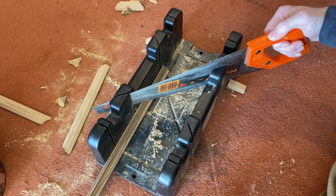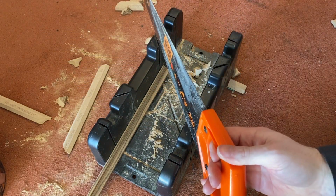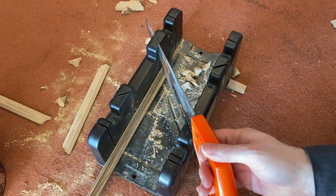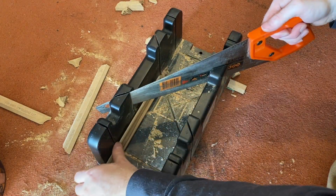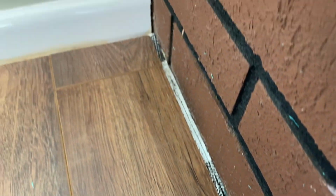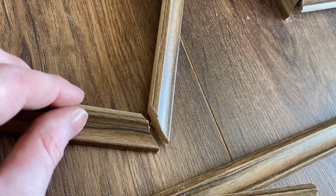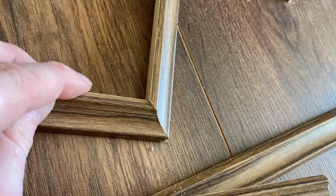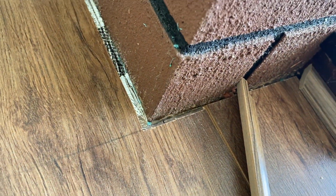When you're doing an outside edge like this, you have to use the opposite edge to the one you used for the one that meets it. So if you cut this first, you meet it with that. So let's just prove that. Let's cut this now. The bit of wood we've cut is just too long to fit in there. And just demonstrate it like this. I've just propped it up like that. And you can see that as an edge, that is going to line up with that, and that corner will translate nicely onto there.